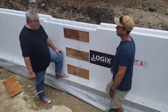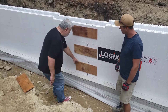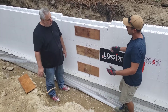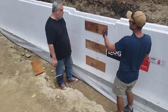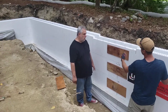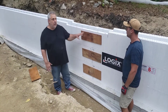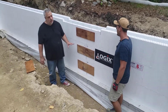There's a reason why you stack these seams rather than staggering them. It has to do with bracing the wall — braces are usually between five and six feet apart. We start from the corners two feet away and then build our way out. This allows you to put bracing here and catch bracing over there, and having the seams stacked in the middle keeps the bracing out of your way.